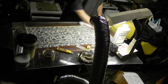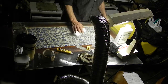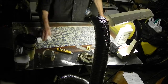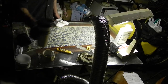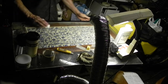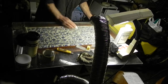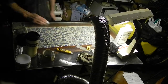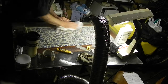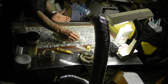We're just waxing the table. Then we're going to mix up our polyester resin for our bottom coat, which is the final finish coat for the actual plate we're making. I've got lots of coffee and lots of wax to wax this glass plate. The glass plate is basically an aquarium that I cut apart, and I'm using the plates of the aquarium as my surfaces. I have another plate down here that will go over the edge, but our fiberglass and Kevlar carbon fiber will be well within this area — 13 inches with a half inch on each end.